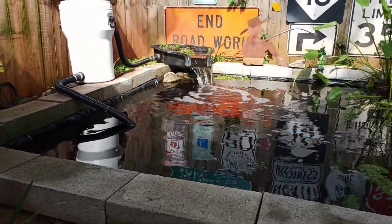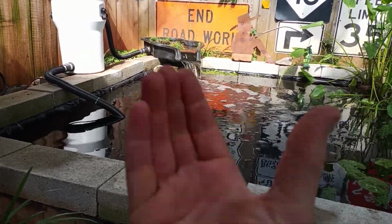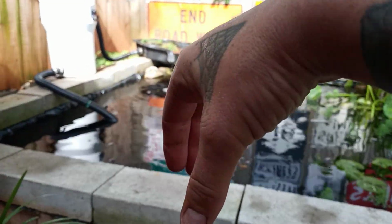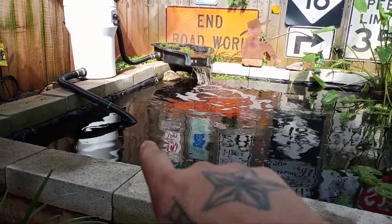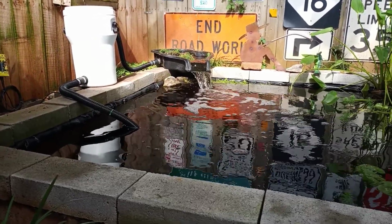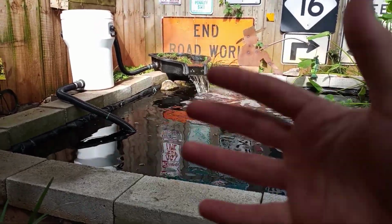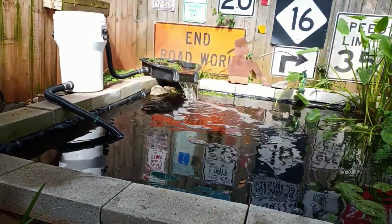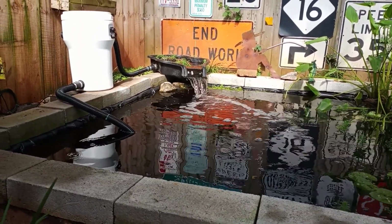What I did today, in the past I had a 5-gallon bucket, right? And I had the bucket upside down, with the hole on top. I took my hole saw kit and drilled a 1.5-inch hole to feed my inlet tube down through the 5-gallon bucket. And then I drilled probably 30 holes, no bigger than 1/8 of an inch, all around the bucket. That way water could come in. And basically that bucket was like a shroud, right? It would go around the pump, and it would keep all the leaves and debris and some of the baby fish from getting sucked into it.